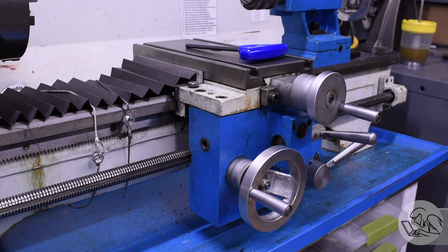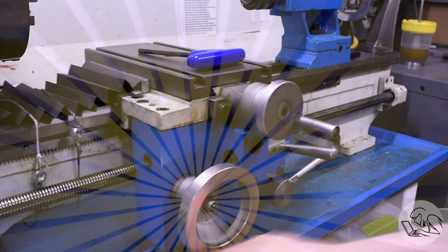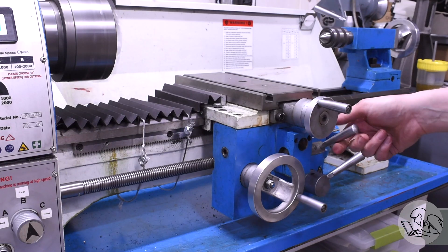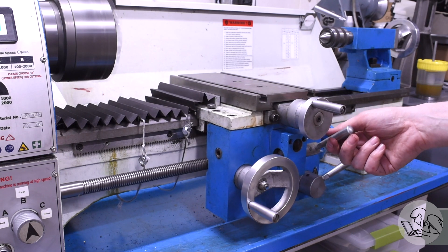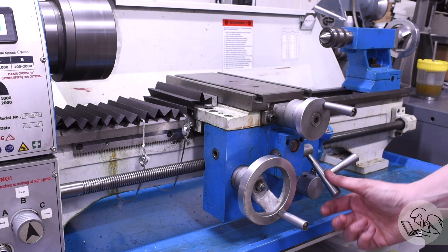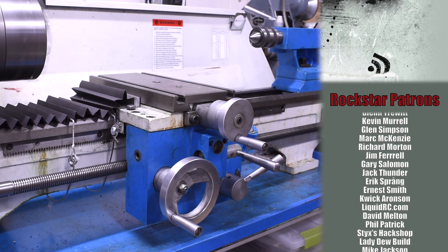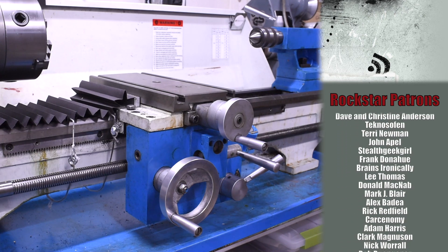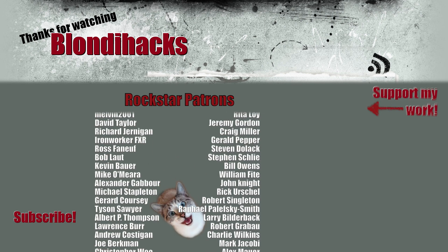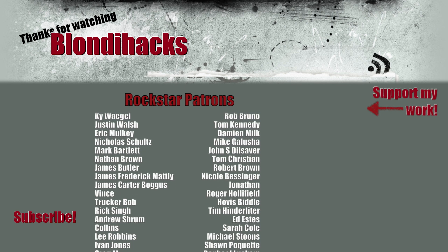Same process back here: start the bolts, tap in the tapered pins, snug up the bolts, and then finish tapping in the pins. I'm also oiling and cleaning as I go. Moment of truth — remove the packing blocks. How did we do? Does the carriage move? Smooth as glass all the way up and down. Results! Quick run through the power feed gears to make sure that's all working — carriage feed, highest feed rate here, all looks and sounds good. Over and down, power cross feed — that looks really good. It's never a good day when you crash a machine, but this was a great excuse to take it all apart, learn how a bunch of it works, and now I'm really comfortable doing this kind of work on this machine. I've also learned I should probably order that drive pinion and keep it in stock, because if I crash the power feed again that's the part that's going to fail. I hope you enjoyed watching this little repair — thank you very much for watching, thanks to my patrons, and I will see you next time.